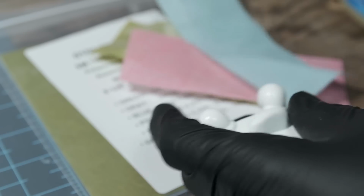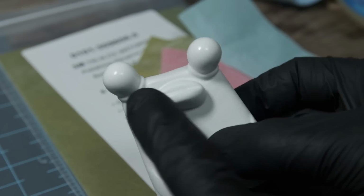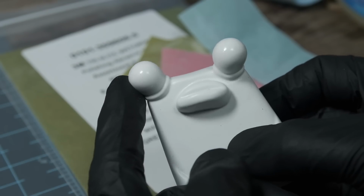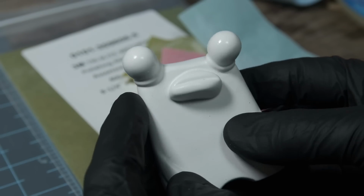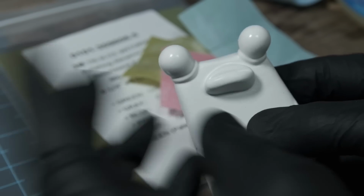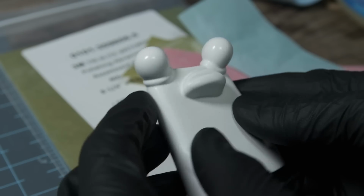If we want the eyes to be glossy, you could take you something like this right there. You can sit up in there and, you know, go through all these different ones. And then I just took me a shop cloth like that right there. Watch this, what I'm about to show y'all. Get ready for this right there. Now, see how glossy that is? The silicone will actually capture that detail. It will capture every little surface quality of your sculpt, your object. And that means all the casts that you pull out of that mold are going to be glossy right there, matte right there. Just wanted to show y'all that.